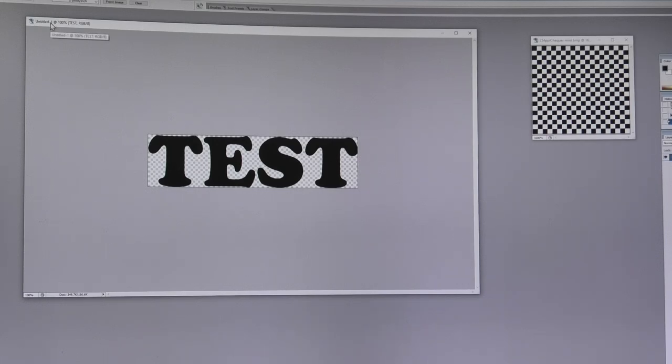So we start off with a black image, which you've seen the result of. It produces smoke, it produces different colours. And you can't do anything about it, regardless of how you play with the power and the speed, you'll still get exactly the same result. So that's not the correct strategy for constant colour engraving. The correct strategy for constant colour engraving is to produce a load of black dots that sit together. That way, you've got blackness, not different shades of brown. So how do we get to that?